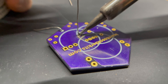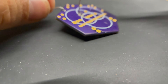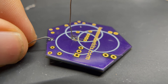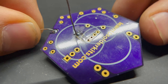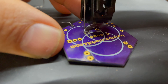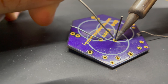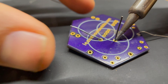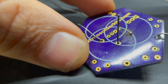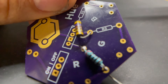When you're getting enough heat transfer and using the correct amount of solder, you should get a pretty good solder joint and fillet. The key things you want to look for are that the solder is nice and shiny and that there's a concave shape to the solder. Now let's show you a couple of things that can go wrong when you're soldering. But first, let's go ahead and trim the leg of this component. Here's an example of when you don't have enough solder — the good thing is, if you don't get enough solder onto the pad and the leg, you can always go back in with additional solder.